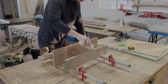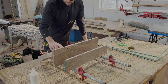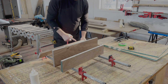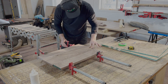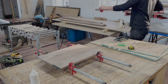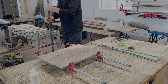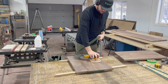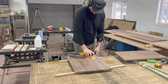Now that they're all ripped to width, I glued my panels together for the seat and the back. I wanted to keep both of these panels to just under 16 inches wide so that once the glue is dry, I could run them through my 16-inch wide planer on a very shallow pass just to clean up any of the glue lines. After I run them through the planer, I give them all a light sanding, then cut to size.